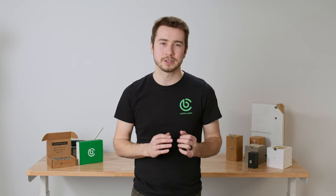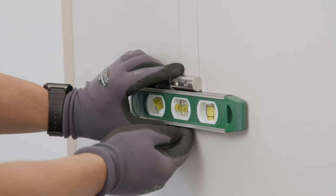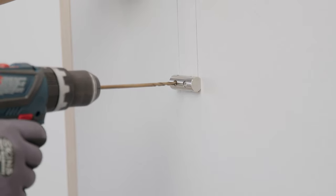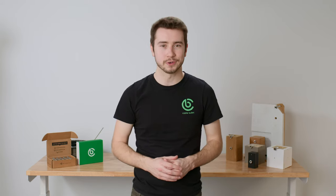Just make sure that you leave enough room so you can adjust your bracket as needed. Now make sure your bracket is level and mark the second hole. Repeat the previous step of drilling a half-inch hole and placing a washer, and then set your second screw.